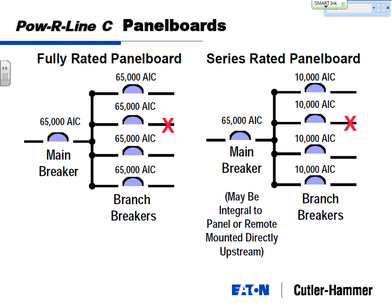Now, how can I do that? It's because as a manufacturer, I take these two breakers and put them on a bench in front of UL and test them, and I say, if I have a fault current on the load side of this one, one of these two breakers will trip. Either this one or this one, I don't care which, as long as one of those two trips and the panel board remains intact and everything can get back up and going once the fault is cleared.